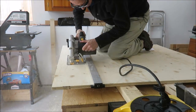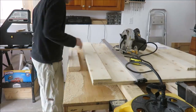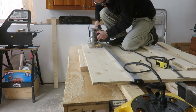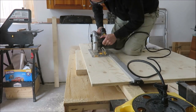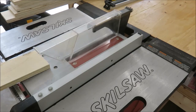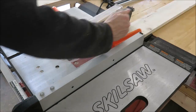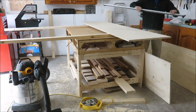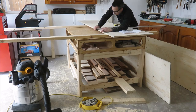I'm using three-quarter inch plywood for this project and I picked up a clamping straight edge because my table saw can only rip up to 12 inches wide. Setting up the clamp for each cut was time consuming and a pain. I built two of these four-foot by eight-foot, two-foot deep garage cabinets. Then I decided it was time to upgrade my table saw. Here I'm running the pieces through my table saw, as my measurements using the straight edge with the circular saw were a little off. My new table saw can rip up to 32 and a half inches — this project would have gone much faster if I had my new table saw.